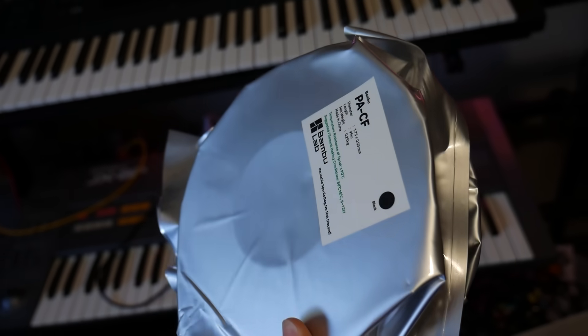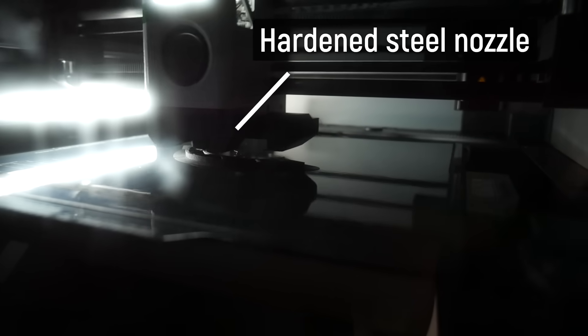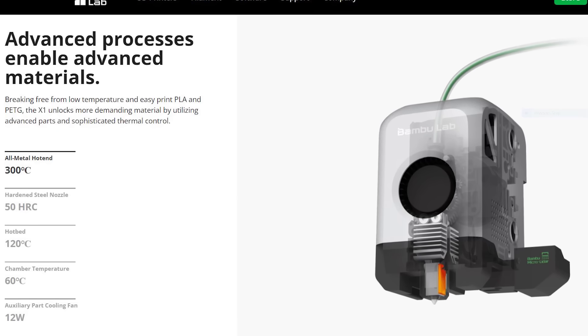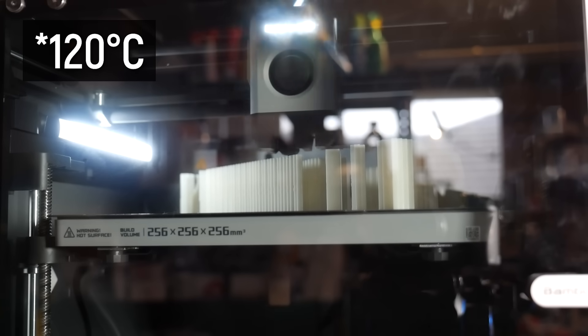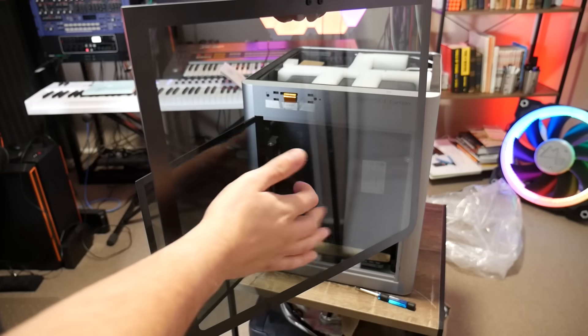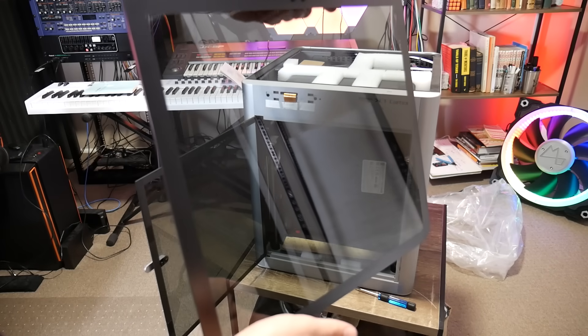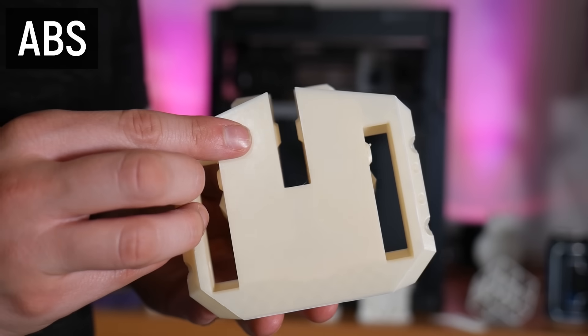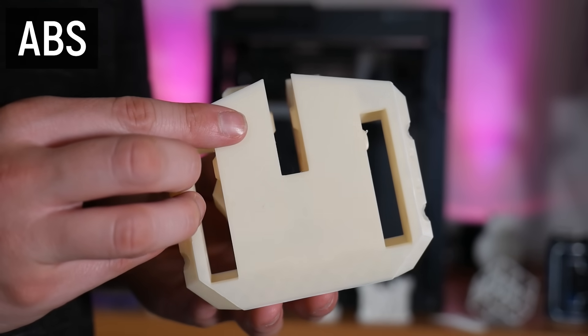The X1 Carbon is specifically engineered to handle hotter and more demanding engineering filaments, so it has the engineering filament surface which is smooth to the touch and works very well. All of my carbon fiber nylon and ABS prints to date have experienced zero warp and simply pop free once the bed cools. To aid in printing those high-temperature abrasive filaments, the X1 Carbon comes from factory with a hardened steel nozzle and a hot end that can reach up to 300 degrees Celsius. Combine that with a bed that goes to 110 degrees Celsius and a robust enclosure with a glass top and front door, and you have the perfect environment for warp-free ABS, PC, and PACF carbon fiber nylon prints.